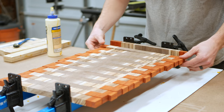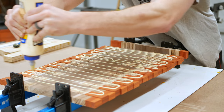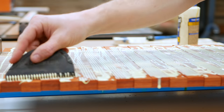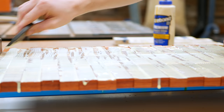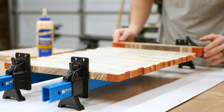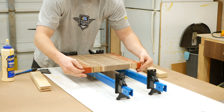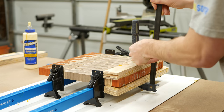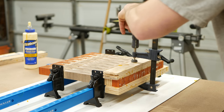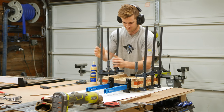The next step was much like the first. To glue things up, I rotated the pieces back down and applied a thick coat of glue to all of the surfaces. You want to have good squeeze out here for this final glue up to ensure that all your surfaces have a really good jointed bond so that down the road, as you use this cutting board and it experiences a lot of wear and tear, things don't open up. Then much like before, I clamped things up using a series of cauls and clamps from all sides, paying particular attention to keeping things as lined up as possible so that the pattern stayed as even and precise as it could. The whole project can kind of fall apart in this step if you allow things to slip and slide in the clamp up process.